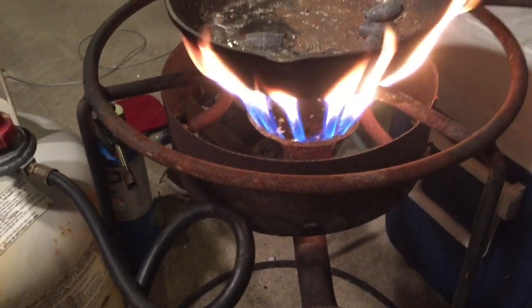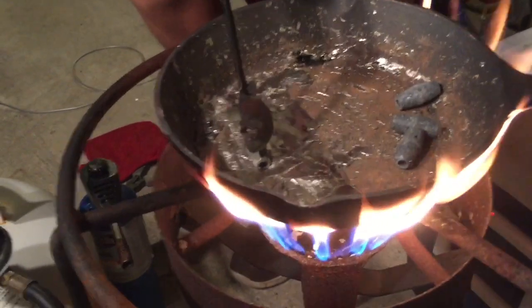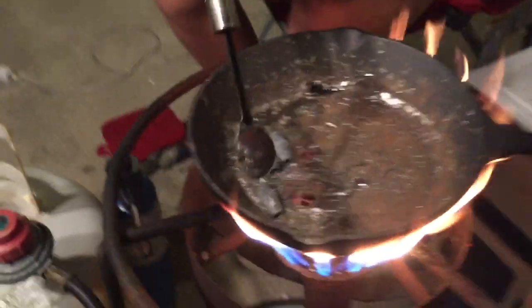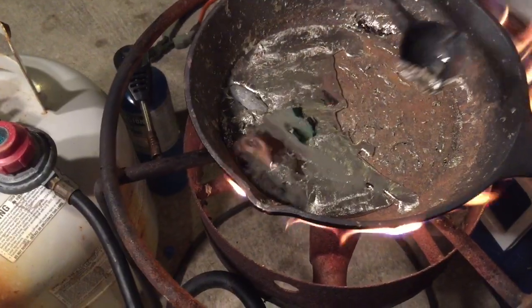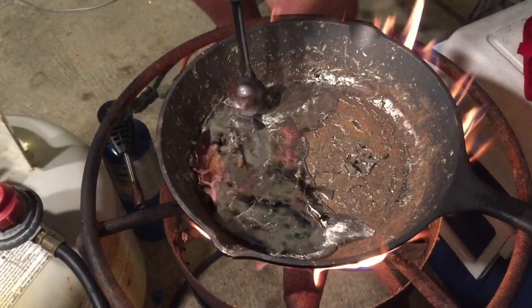Here we have our little setup — it's just a crab boiler going up to a cast iron skillet hooked up to a propane burner. The cast iron skillet is where we put the cast net weights in, and they melt down to a liquid in probably about 30 seconds. We also have a bucket of water — that's for whenever the slag from the lead comes up. You'll want to scrape the slag to the side, pick it up with the spoon, and put it into the bucket. Keep the bucket far away so water doesn't get in the skillet and explode.